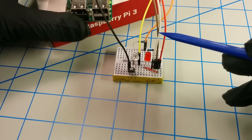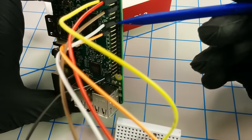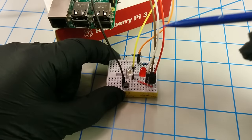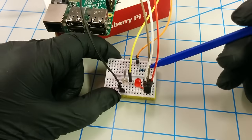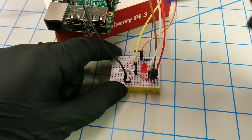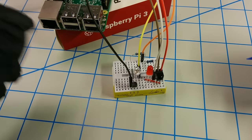The last pin, which is output, is connected to this white jumper cable and goes to GPIO 18 — so this is the input. Essentially, when the code hits the receiver, it sends the output signal down the white wire to GPIO 18. Also, this 200-ohm resistor is hooked up to the same output pin, so it'll send power and theoretically light this LED so we know we're getting the codes, and that input gets directly fed into the Pi for the LIRC package to interpret.